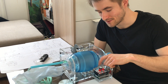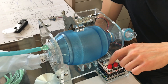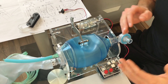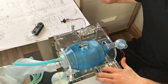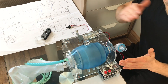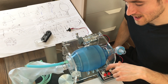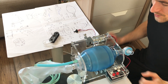Down on the UI here you can also change the frequency of the breath. By pressing this button — you see that blue light that comes on — that increases the frequency from 10 breaths per minute all the way up to 30 breaths per minute in one BPM increments. When you see the red light, that's when it reaches 30 and won't let you go any higher. Conversely, you can turn it all the way back down to 10, where the red light shows the lower limit.